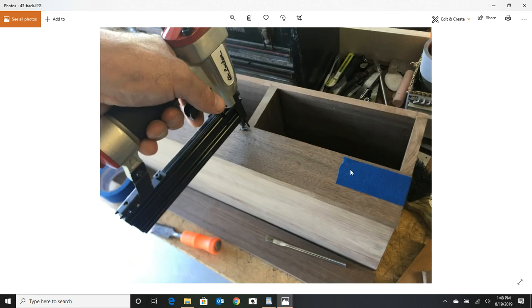When I built this thing, I knew it was going to be up against a wall. When you're building drawers you're constantly putting them in and out, so I wanted a way to stick my hand in the back. I don't like having boards go all the way down — I once did that on a white oak desk and I didn't allow for the wood to move with the seasons, and I ended up with a bunch of cracks. So I used quarter inch veneer on the back and some half inch pieces in the corners just to keep them from moving, with the rest open.